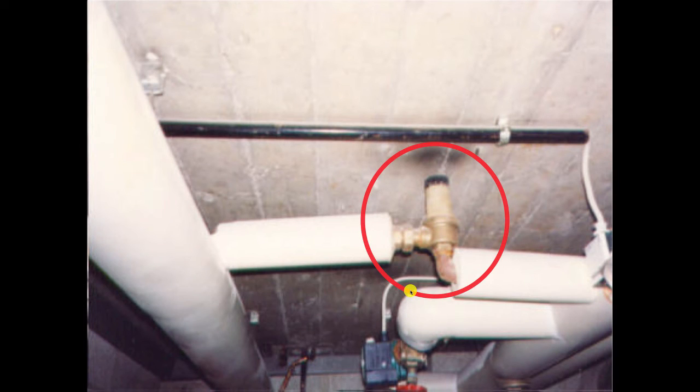And they're pretty simple to use. Here's one in real life. It's sort of a relief valve that doesn't pop open. It meters itself open, and it's got a knob on the top. So the way you would set this up is you would start out when the job was new with all the control heads removed from your thermostatic radiator valves throughout the whole building. You then set your circulator, and this thing would be in the boiler room from the pump's discharge back to its suction side, and you would turn this knob on the top while feeling this pipe.